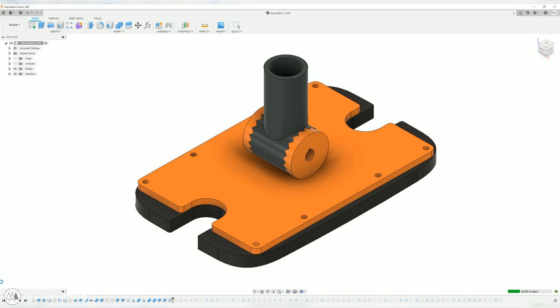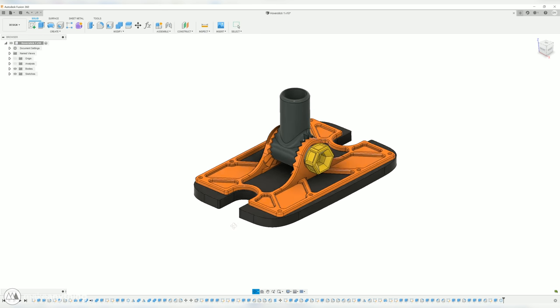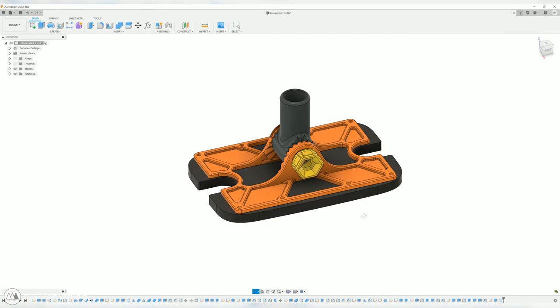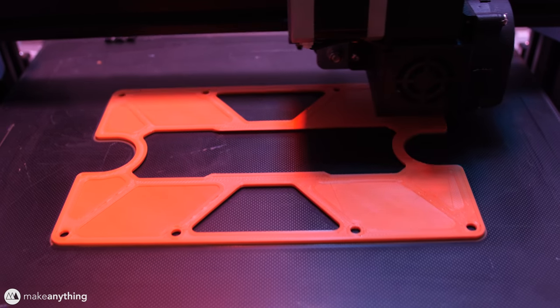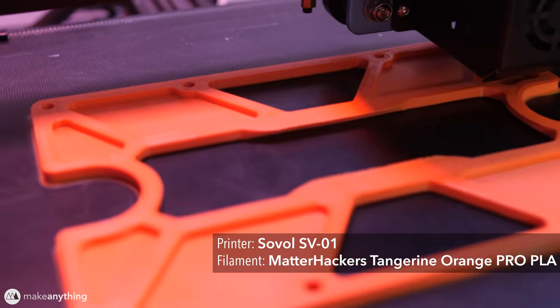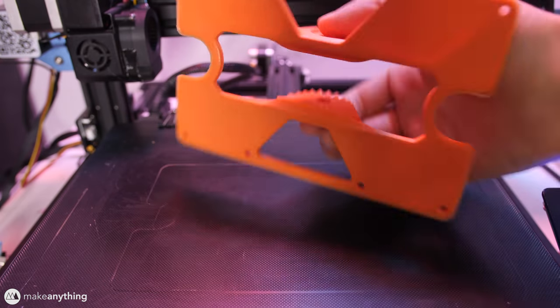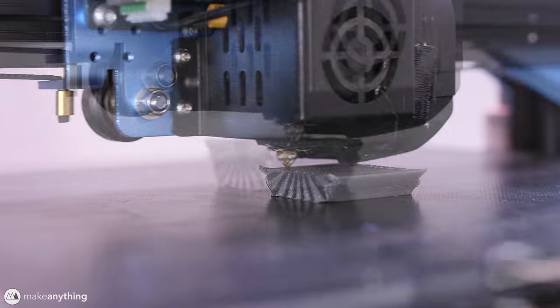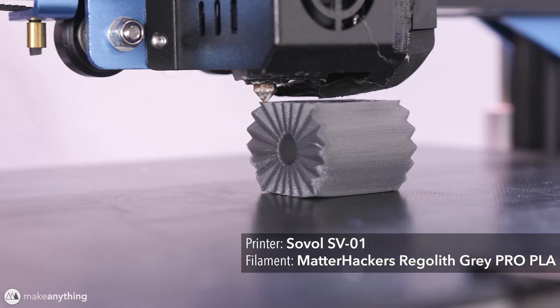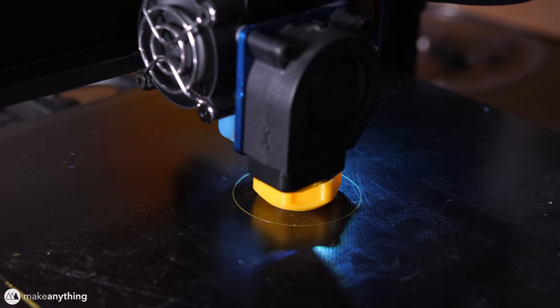With that straightforward plan I jumped into Fusion 360 and started modeling my parts. These parts are just going to mount the broomstick to the hover shoe and allow me to fix it at a certain angle — it kind of looks like a fancy Swiffer, which is a modern-day broom, so it couldn't be more appropriate. With my design looking good on the computer, I went ahead and started printing them out. While it might be more appropriate to print in ABS or ASA plastic, I'm just using Matterhackers Pro PLA because this is a prototype, and it's a pretty strong PLA with the necessary flex.